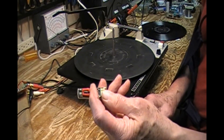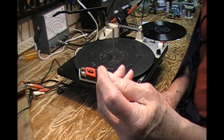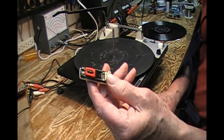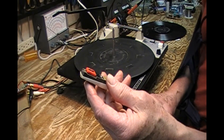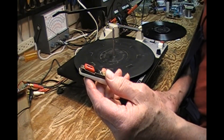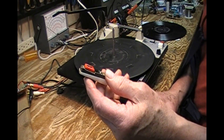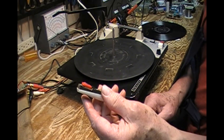I only like the ones that have this rubber insert and the hollow tube shank that supports the actual stylus itself. The other ones are more reminiscent of the early 60s, late 50s, where trackability was not even heard of for these things.